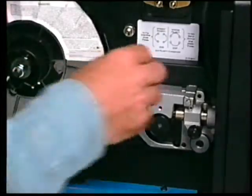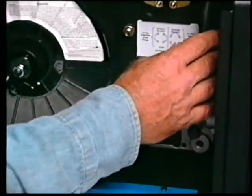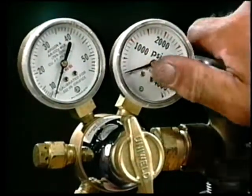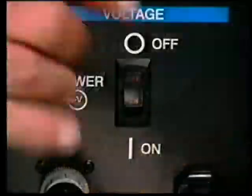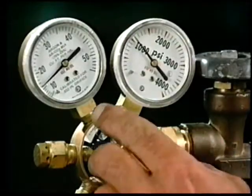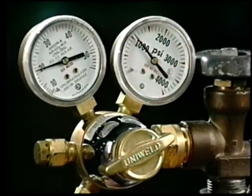We do this with the power source turned on, and we have to actuate the gun trigger. Now that makes the wire hot. If we allow the wire to feed, it could come into contact with a work clamp or whatever that clamp is connected to. So Miller recommends that before turning on the power source, the drive roll tension be released so wire won't feed. Next, close the flow adjust knob, turn on the cylinder valve, turn on the power source, and while pulling the trigger on the MIG gun, open the flow adjust control until the gauge reads 20 cubic feet per hour.